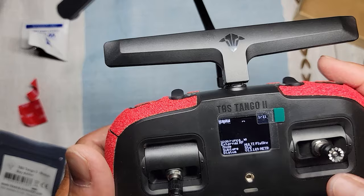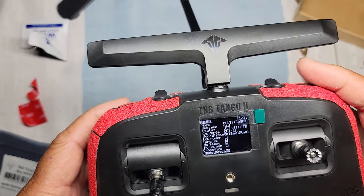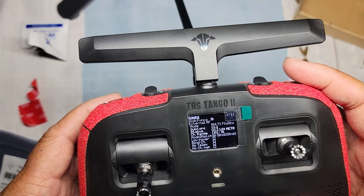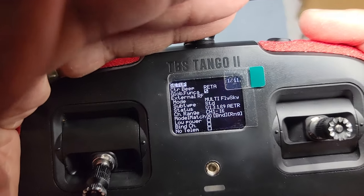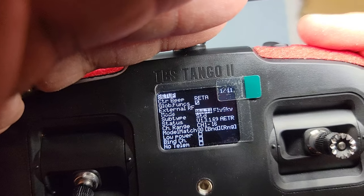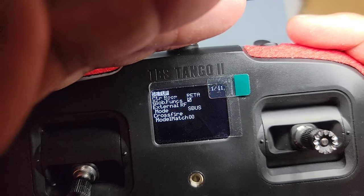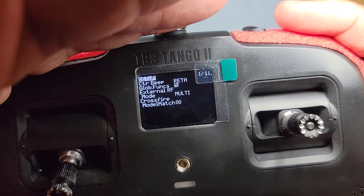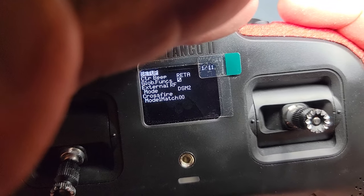I'm going to go to menu and try to set External RF to multi — that helps. I'll turn External RF on to multi. I flip it over and the module is lit — yes, it's lit. So I did something right. I will bind this up to something like a whoop. Can't really use the kickstand anymore with this module on it — it kind of balances on the module, so you have to be careful when you put it down. To turn the module on or off, go to External RF mode and select multi or off.